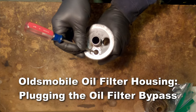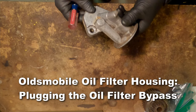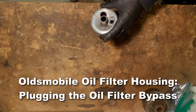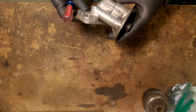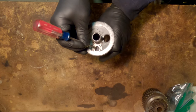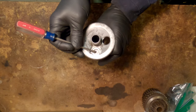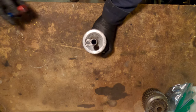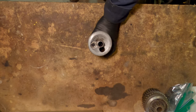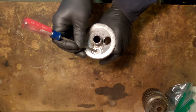You can see here, this is the flap. In my experience with all the engines that I've worked on, I've never seen a plugged oil filter. It's pretty uncommon, and in my opinion, I would rather have a sudden drop in pressure that I would most likely notice, rather than have the chance of any kind of metal going through the engine. I've seen way more issues with metal going through bearings, scraping up your journals, than I have with plugged oil filters.